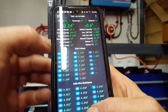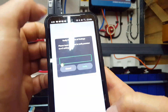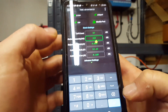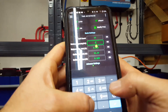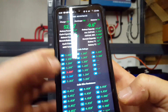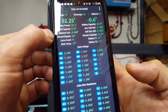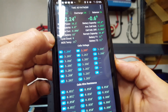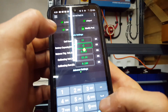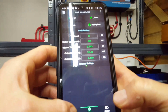I'll go into this one, and although it's showing zero I'll change it to restart. Verify password: one two three four five six. Change to 60, okay. Now even though this one wasn't showing the cycle count, the remaining capacity has changed to 65% and cycle count is zero — so that should have reset this one as well.